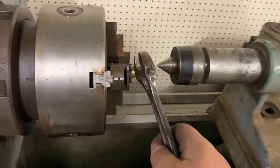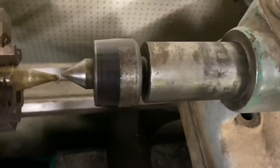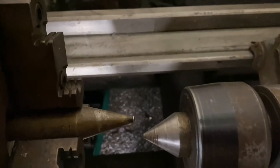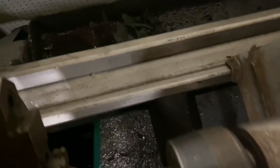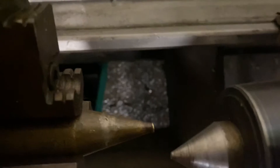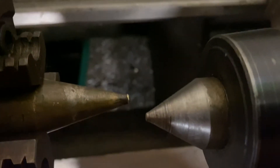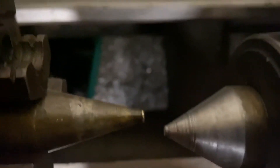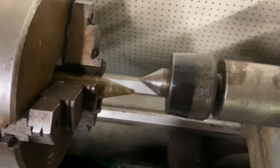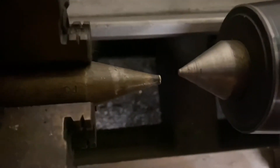I know that's not a lot — just a center in the headstock — but for what we're doing today, this is good enough. I want to see how much adjustment there is in the screw right here. We're off a bit — well, more than a bit for what we're shooting for. Let me get the wrench on there. We are moving — looking good, looking good. And look at that, half the job is done. There's plenty of movement; I went past it a bit, but that adjustment will dial us in.